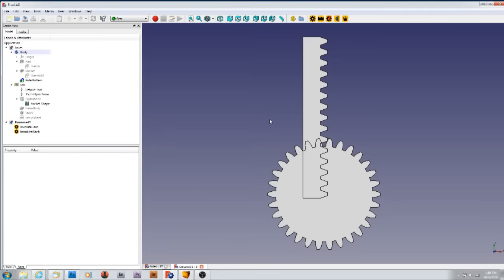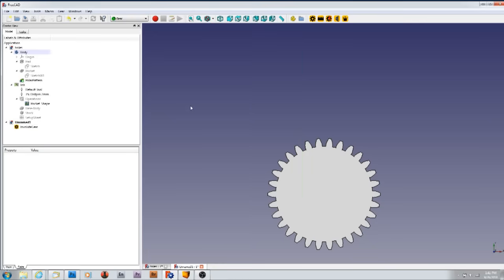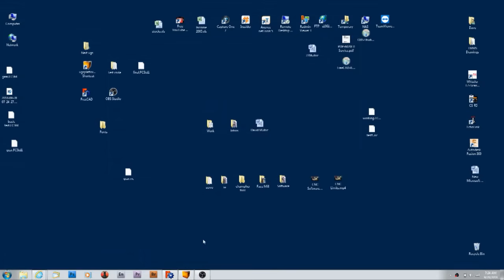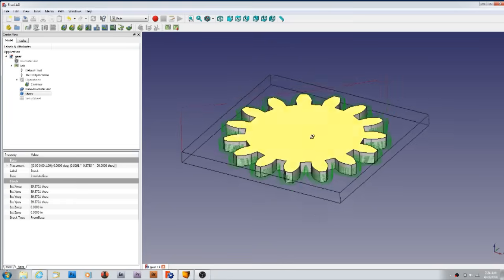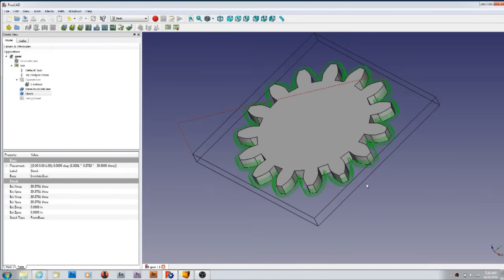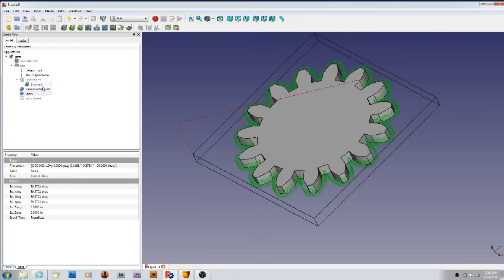The tutorials go all the way up to the point where — okay, you made it — but they don't go into PATH to tell you the tools and how to create the G-code to actually machine the gear. To create a contour path for the base object, I just selected the top and then went through the different steps: depths, step down five thou, start depth zero, final depth minus fifty thou. I didn't want to go all the way through the plastic into my table.